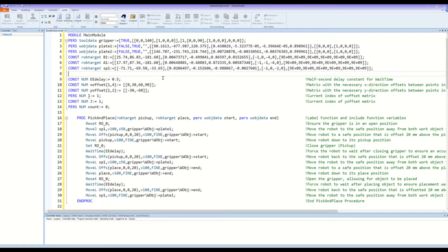In this first portion, we identify the matrices and variables used throughout the program. This includes the wait time delay of a half second that will be used after the robot has picked up the object — essentially closing the gripper — and placed the object — essentially opening the gripper. From there, we have our X offset matrix and our Y offset matrix. The plates used in this pick and place operation are 3 by 3 in which each slot is 30 millimeters away from each other in the X and Y direction. Hence why within our matrix we have values that are 30 away from each other. After that, we identify the current index of our X offset matrix and Y offset matrix, and lastly we identify our count variable.